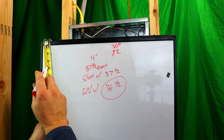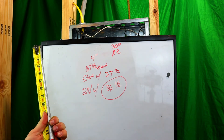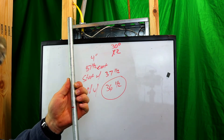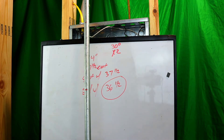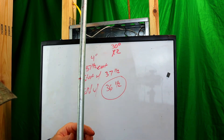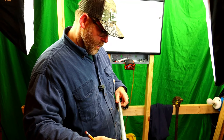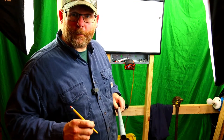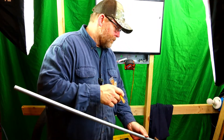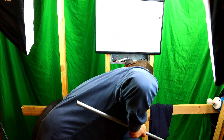We'll mark at 12 inches, and the distance between the marks should be eight inches — and it is. So we're going to take this pipe and bend a four-inch offset on it, and we're going to see if we indeed lose the inch. I'll have to remark it because the erasable marker came right off. No editing — we're just going to go ahead and bend it in the bender.